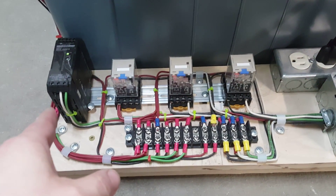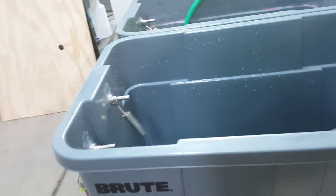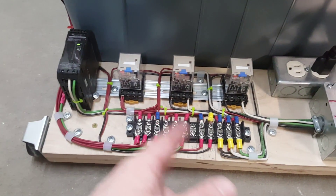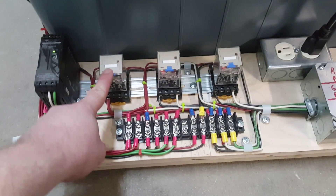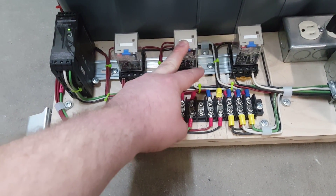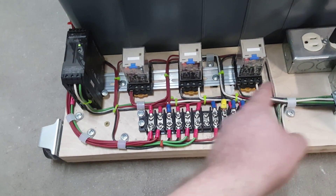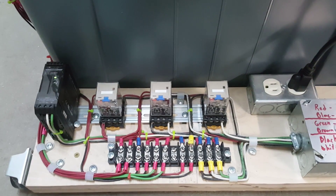This is an AC/DC converter that converts line power to 12-volt DC, mainly because the float switches can only handle low current. The relay coils are also 12-volt DC. One relay controls the float switches, and when triggered, that activates the second relay which actually starts the pump. The third relay here is for the overflow alarm.